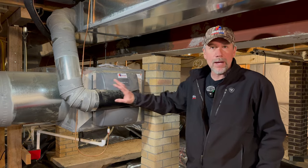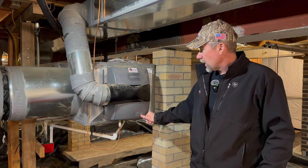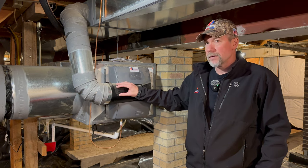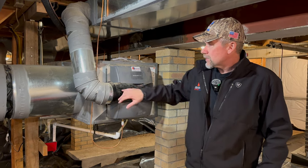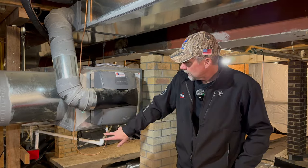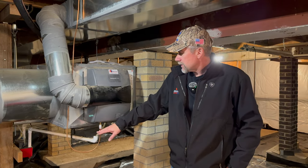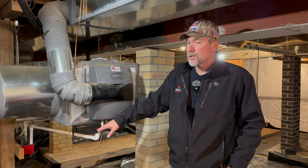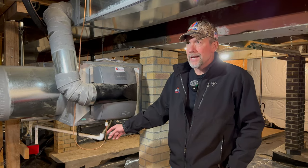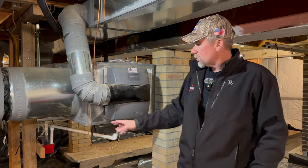This is our Honeywell bypass humidifier. The three indicator lights tell us if it's humidifying, needs service, or if the pad needs to be changed. We use the advanced models with power dampers, which prevents air from circulating through the humidifier when it's not in use — customers don't have to shut it off manually. We run copper lines instead of the included vinyl because vinyl doesn't last as long, and if it's connected to the hot line near a water heater, it can melt the internal tubes and cause leaks. Copper also dissipates heat and protects the internals.